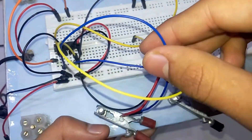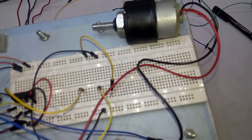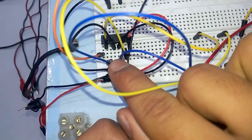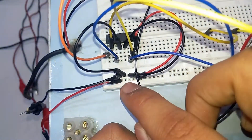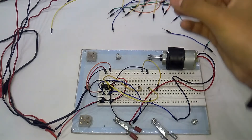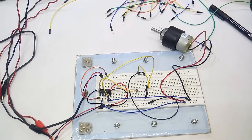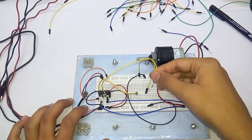The third terminal is connected to this blue wire, which goes to the motor's red wire. The other wire of the motor - the black one - goes to another blue terminal, which is connected to the second output. In the center we see two black wires going in - that's the ground connected to the ground rail. You can also connect the ground to the heatsink. When making a project, you should put a heatsink over the L293D IC.